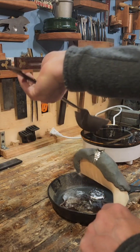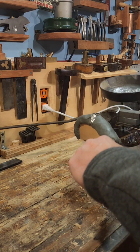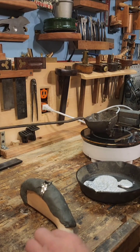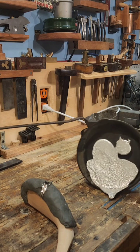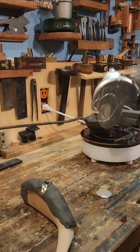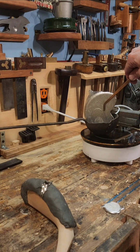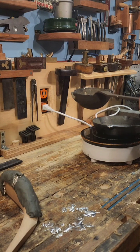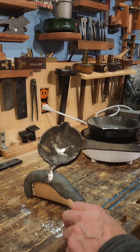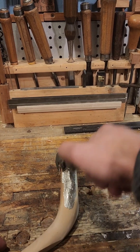Now I've got a big mess on my hands. The first time I'm not wearing gloves, so I couldn't grab it and tighten that up. Just stay calm and try to pour that back in. Unfortunately it had solidified already, so I had to work fast enough that the bismuth tin didn't cool off. Even if it did, it is cold fusible, but I think the bond is going to be stronger if I could get it while it's still melted. I'm trying to get this thing to melt — it melted in a couple minutes and I think it was still liquidy enough. I tightened up the clay a little bit more and luckily it sealed up. All in all, it worked out.